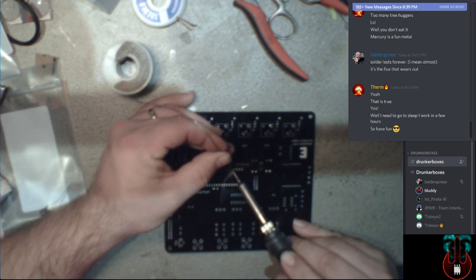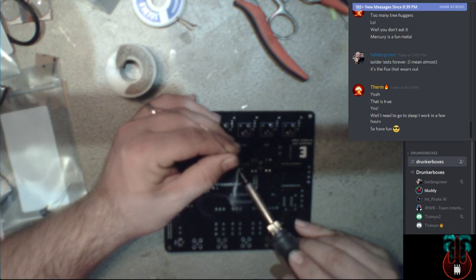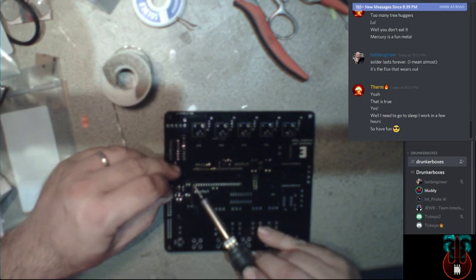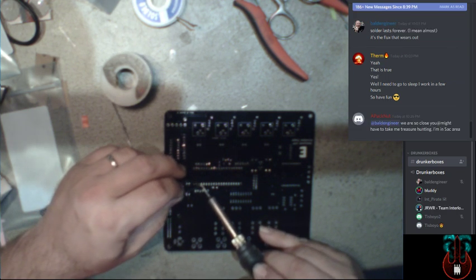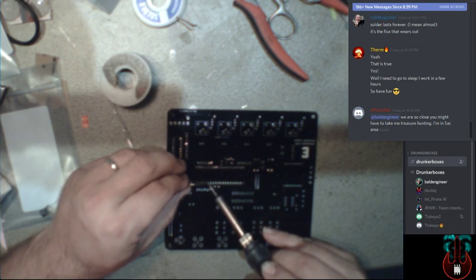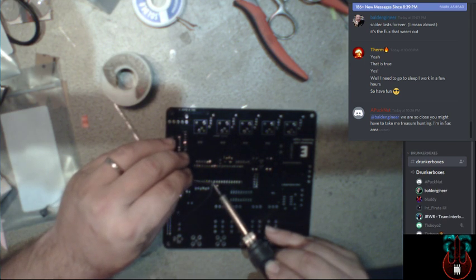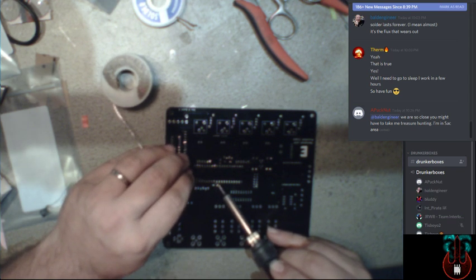Yeah. I found out that with Arduinos, bitwise shifting, even if you're just turning output pins on and off, is, I believe, like 4 clock cycles faster than setting the output to high. Well, are you talking about using Arduino digitalWrite or using bitwise port registers to turn on outputs? Right, because this isn't actually using analogWrite at all.